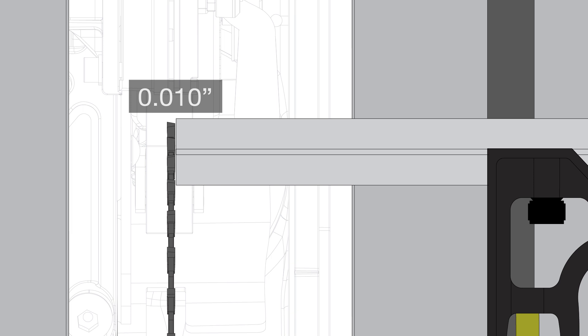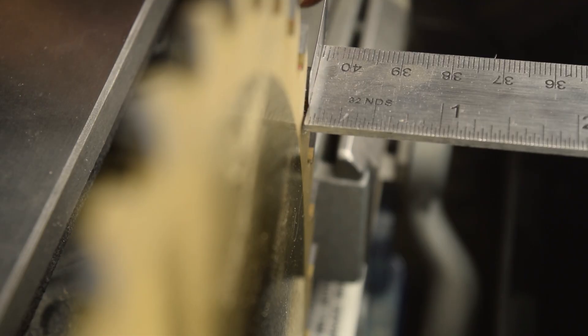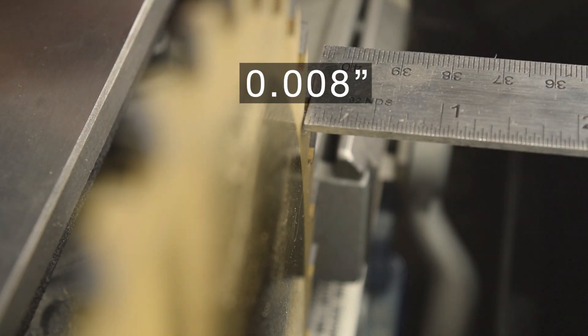The tolerance limit is ten thousandths of an inch. This is the difference in runout between a tooth as measured at the front of the blade and that same tooth as measured when at the rear of the blade. If your SawStop industrial cabinet saw is under that tolerance, there is nothing to be gained by working through the adjustment process. Further, if you are happy with the precision of your cuts for the particular work you are doing, there is no value in adjusting the table alignment.